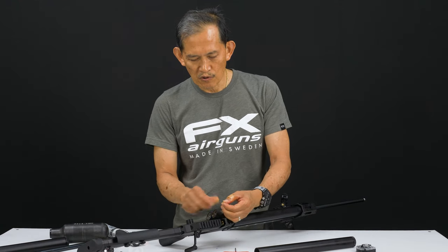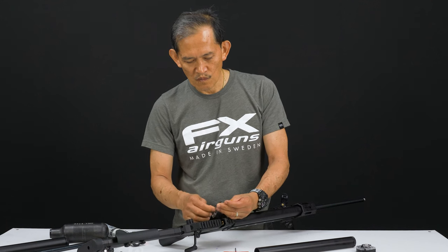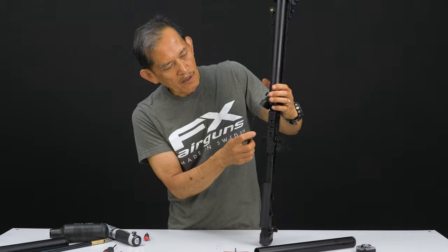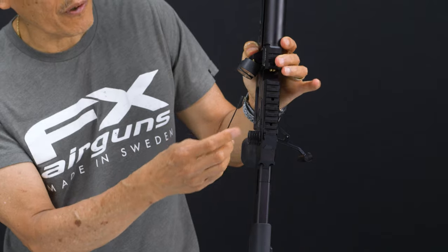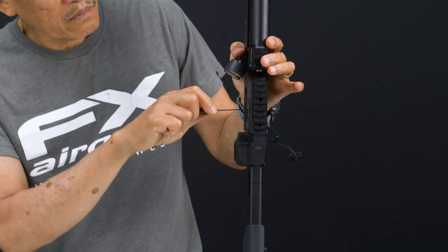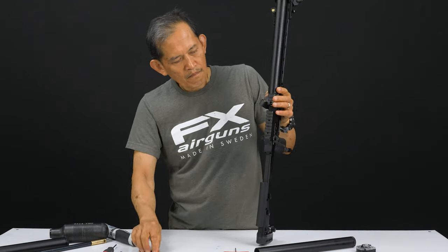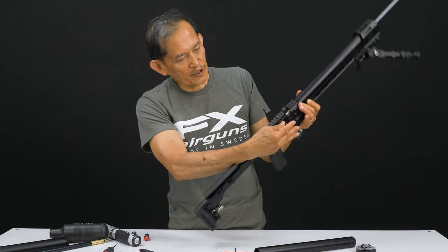It's critical to put the set screw in when the probe is totally aligned with the carrier — the two are perfectly aligned together. Now that it's cocked, put the set screw in — the probe is not going to be straight if you don't. Just hand tight. Cycle it and make sure it's smooth going in and closing.